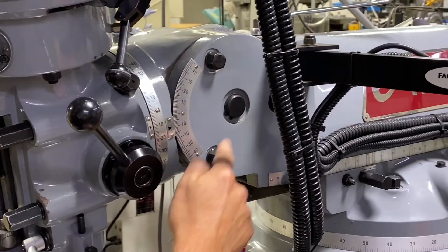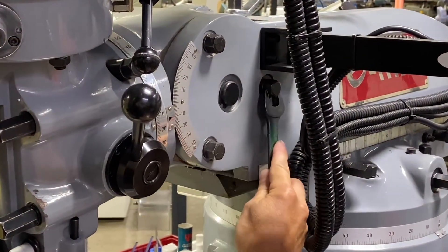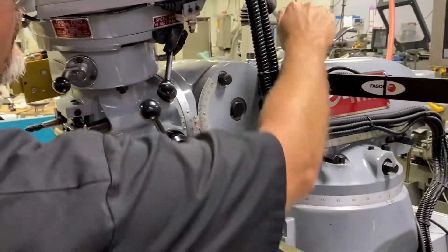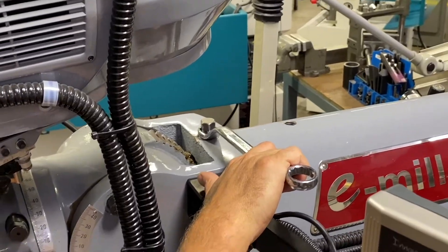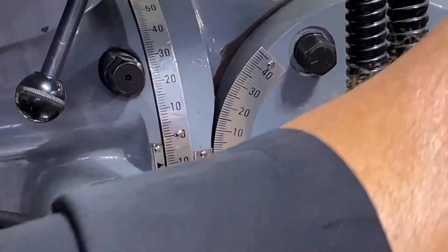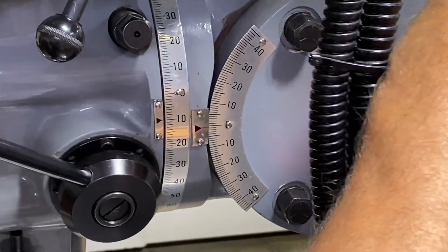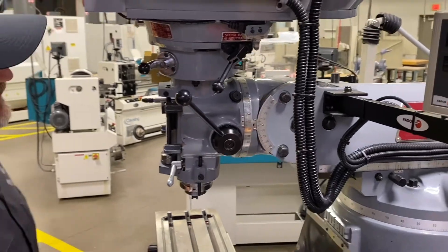I'm going to start with the tilt of the head. I have three lock screws that lock this in position, so I'm going to loosen those lock screws very slowly to allow me to rotate this part of the tool head. Once I have those loose, I can go up to this rack and pinion gear and rotate that. I'm going to take my alignment indicator and bring that right up to the zero degree mark — that's going to get me fairly close before I even start to indicate this in place. I'm just eyeballing the indicator mark to the zero degree line. At this point I'm not going to lock these in place because I still have to do some fine adjustment with the indicator.